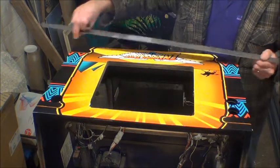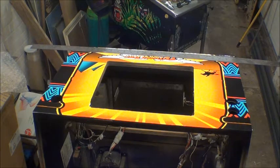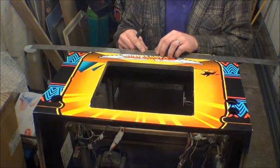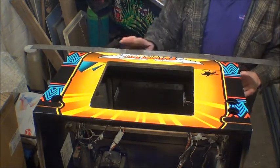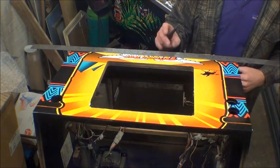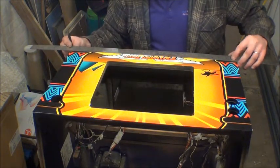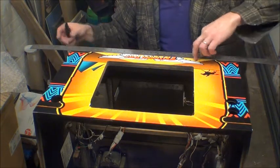What we need to do is lay that along there, I have to put my glasses on now. We need to position it probably about, we've cut that off level, and if you look at a pinball machine, at the bottom of here it's got a tapered chamfered edge, so we need to expose that, and about another 2 millimeters up, so I've cut that all off level. So now if I put that on there